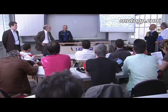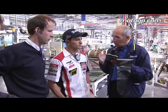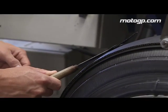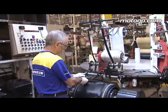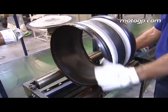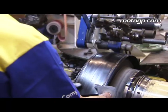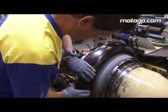It's very hard because it's not so easy to produce one MotoGP tire. The people are very focused on the job, and I understand well what is the difficulty to make a tire. For me, it's also better to understand when I'm on a bike. It starts by having the carcass on the drum. Once we have the carcass, we are able to put the beads, put different rubbers around the bead, and also put the sidewalls of the tire to give the final assembly. At the end, another very important part is the tread, which we coat around the tire — that tread will be in contact with the asphalt to get the maximum grip.